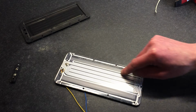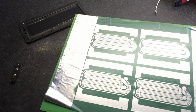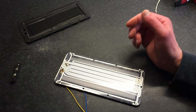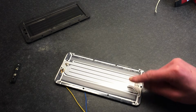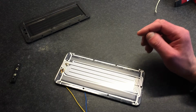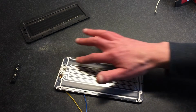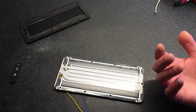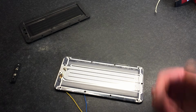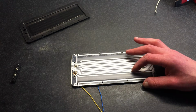They have again this one trace that's going in the wrong direction. I just etched some of my foils for the tiny version with this same feature. I already did before, but with the versions before, this trace will be really close to the spacers. These last panels are a little bit wider, and I never tried it, so I wonder if it makes any difference, but we'll see. So they use tape here, here, and also over the contacts, which was annoying because I had to peel it back, but it only comes off in tiny flakes. Not nice. It measures 3.5 ohms DC, and it feels like it's a pretty thick track.